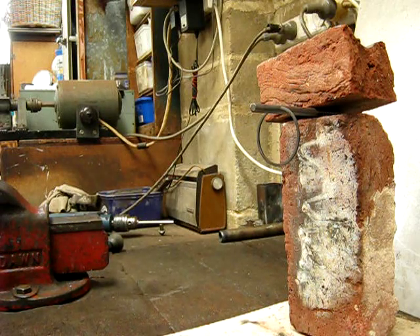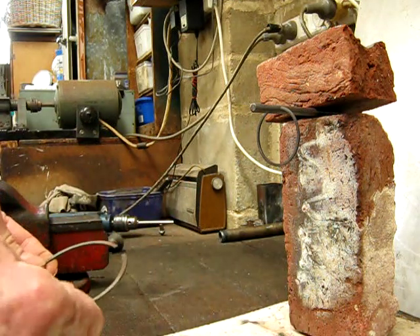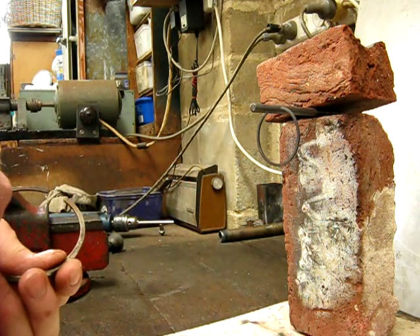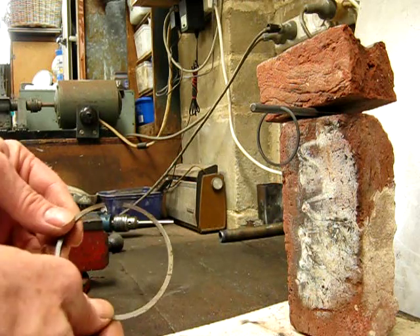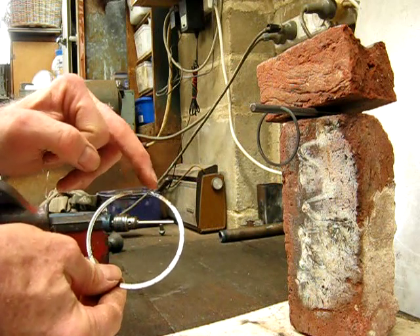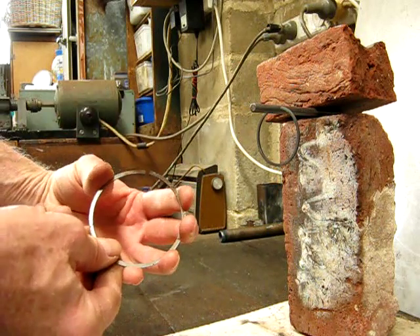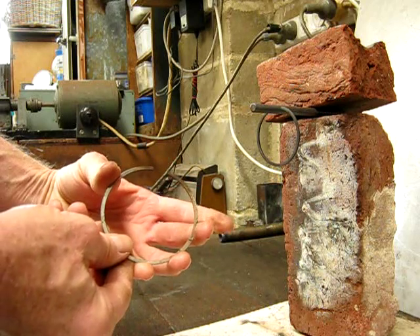In this demonstration I'm going to show you how to put some set in your piston ring that you cut off the other day. And basically you're going to expand it. The degree of set is basically - this is a commercial ring - the degree of set is that gap there. So you've expanded that ring out to that position from the normal position out to that.